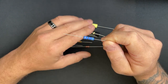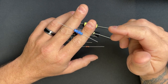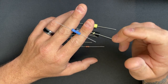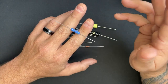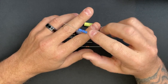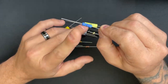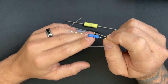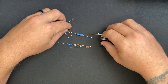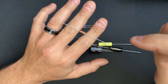The different colors of the metal oxide resistors indicate their wattage. I believe this one is three watts, two-watt versions come in gray, and then there are green ones which are the low-mass versions at around three to four watts. The only thing differentiating them by color is wattage.